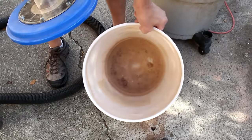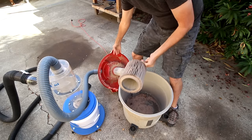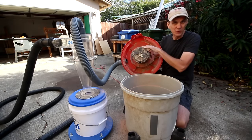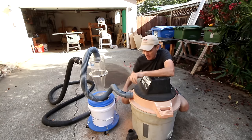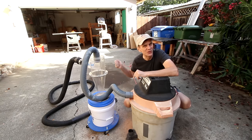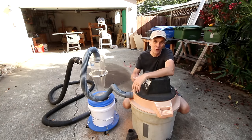There are a lot of good reasons to collect the sawdust before it goes into the shop vac. The most important part of a shop vac is its filter, which collects the dust particles and lets the clean air blow out. These filters get clogged very quickly under normal use, which reduces the vacuum suction. By adding this stage before the vacuum, the filter stays cleaner and the vacuum retains its power. Another benefit is being able to see how much sawdust is collected in the bucket and empty it before it gets full. When I was using just a shop vac, it was amazing how often I would experience no suction power, only to realize that the shop vac was completely filled with sawdust burying the filter.